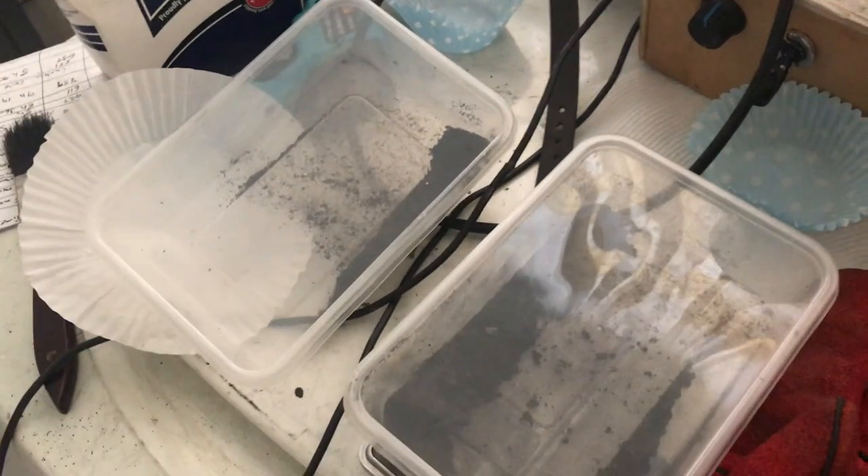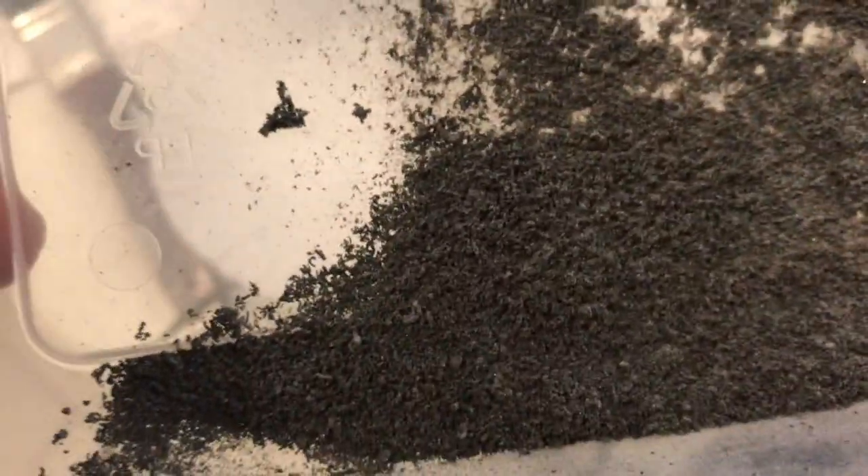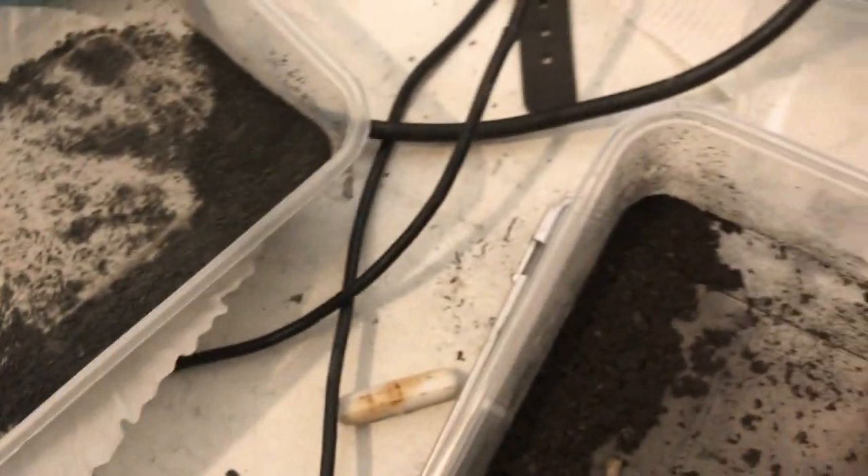The rock form, which was about 15 to 20% graphite content, did expand but there are other contaminants in it because it's not refined. That might actually help at the refining stage — you can pre-process the material. I'm going to try soaking that in water and hopefully the graphite flakes will float to the top while the impurities sink to the bottom.